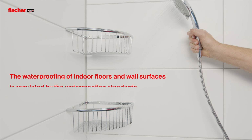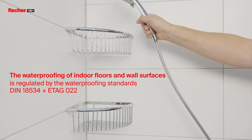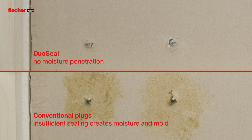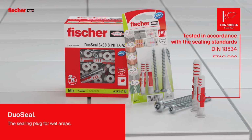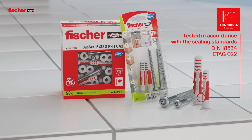The waterproofing of floor and wall surfaces in wet areas is regulated by waterproofing standards to prevent structural damage. The inadequate sealing by conventional plugs can lead to moisture and mold growth, whereas the DuoSeal is designed to stop water getting to the areas behind. The Fischer DuoSeal completely seals the drill hole. The nylon plug has been independently tested in combination with the screw included.